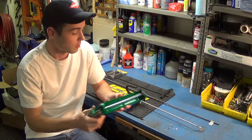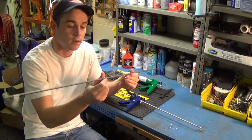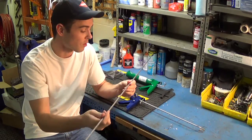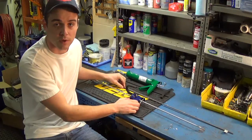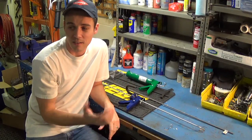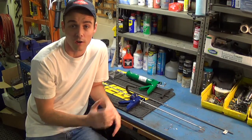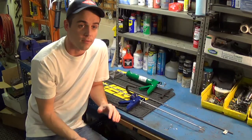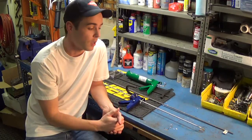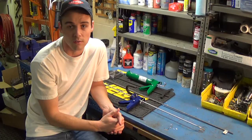Once you find one of those, you're going to need to get a quarter-inch thick steel rod. I would go with the four-feet long, 48-inch variety. The first one I made with a three-foot variety, and after making it, it was barely enough to activate the brake pedal on a standard car. On a truck where the steering wheel is farther from the pedals, it wouldn't even work without a block underneath. So I'm making another one — I'll have a four-foot and a three-foot variety.